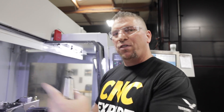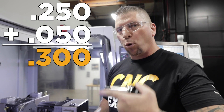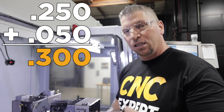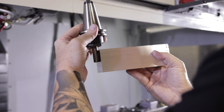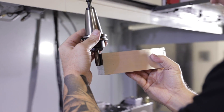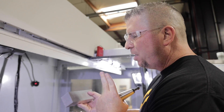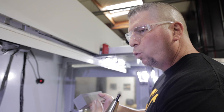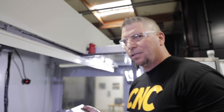Here's the trick: if I actually want to cut 50 thousandths off, I just add the 50 to 0.250, which equals 0.300. That makes it so when the material comes over it actually overshoots by 50 thousandths, and then when you come and clean it at zero you will have taken 50 thousandths of material. Makes sense?